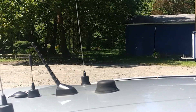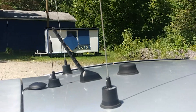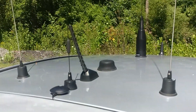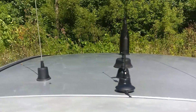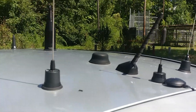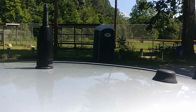Next up is the little puck antenna in the middle of the vehicle. This is a modified GPS antenna with the filter removed for Inmarsat and Iridium reception. We then have the 2 meter antennas on either side — the right one for my scanner and SDR feeds, and the left one dedicated to APRS. In the center is a 900 megahertz amateur radio antenna, and right behind that is my GPS antenna which feeds my Windows tablet used for APRS operation among other things.